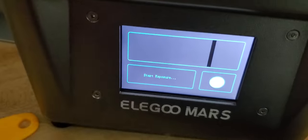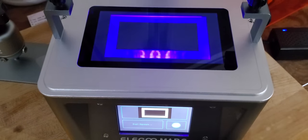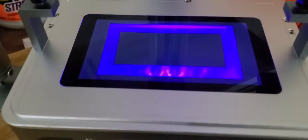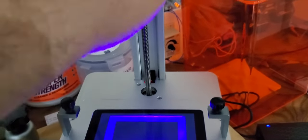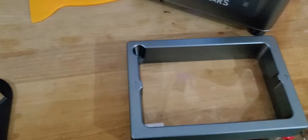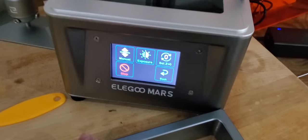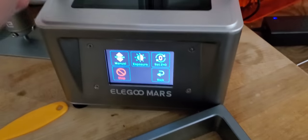Go right here and hit next — that's going to start the exposure. In a second you should see the light come on — and there is the pattern. It matches the screen. It looks to me that everything is working properly. You can hear the fan, the Z went up with no problem, very smooth, everything's nice and solid. All the commands seem to work perfectly fine, so I'm pretty confident the driver's carelessness didn't damage the printer at all.